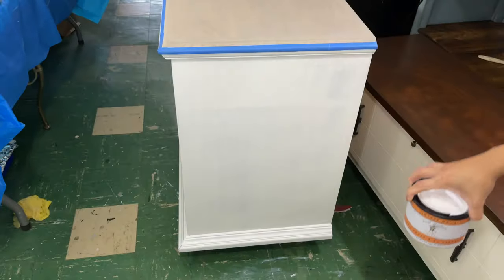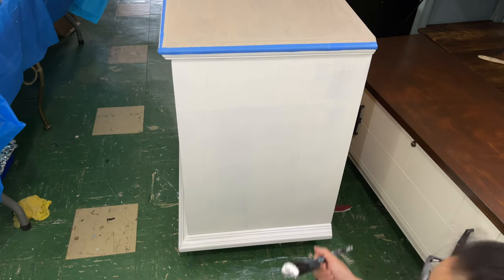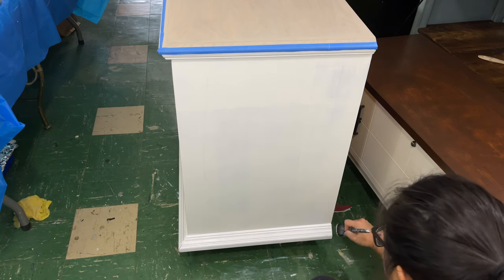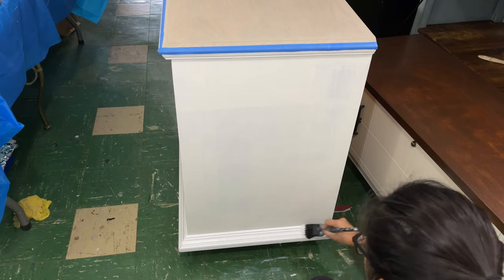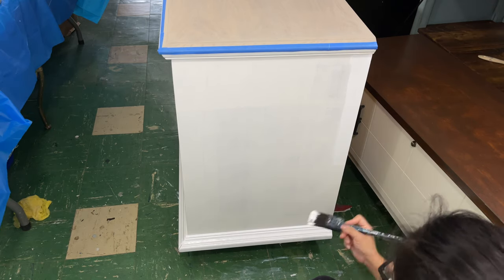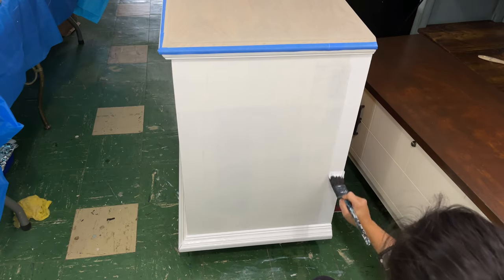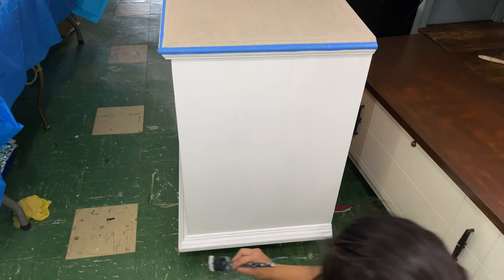I'm using the color Vintage White by Junk Monkey. I'm really impressed with the coverage — it's a little thick so I used a spray bottle to thin it out slightly. I did two coats and it covered the piece really well, which also helped because I primed with white primer. I love this paint — there's no smell, it was easy to apply, and I was able to recoat in two hours.